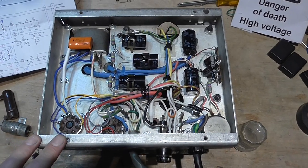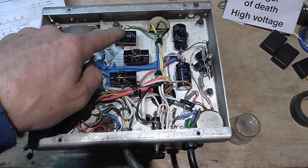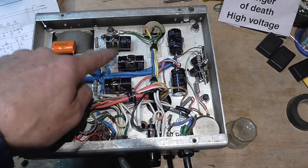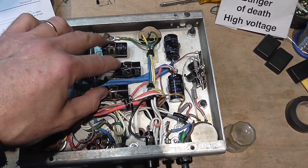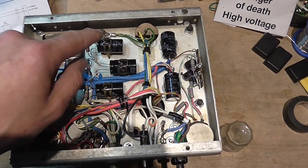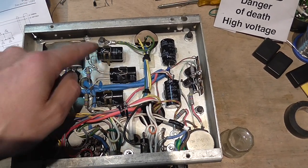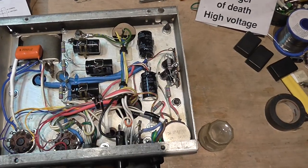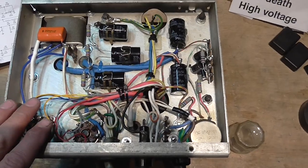This is the underside of the power supply. As you can see, I've measured every one of the capacitors. These were replaced some years ago in this power supply — but they measured really well, both in capacitance and in ESR. Then I rewired everything.